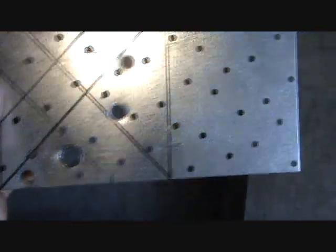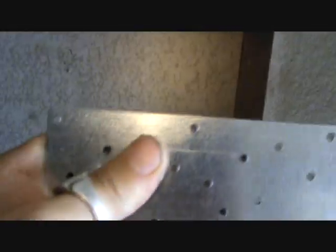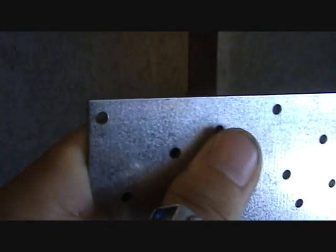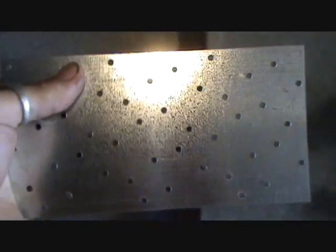So I can come back and bang a few holes through this. What I'm actually going to do is, rather than just going with a single plate, I'm actually going to double the thickness. I'll probably drill a few small holes - I've actually got some small nuts and bolts, very tiny, used on PCs and stuff, that should go through those holes and lock them into place. Then I can drill - I'll do one, make sure I get it right, then use it as a template and just drill straight through the other one.